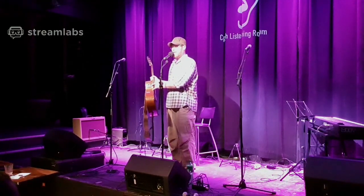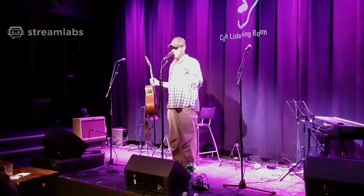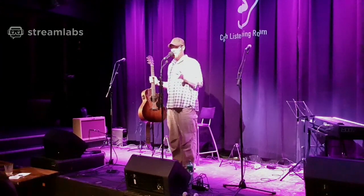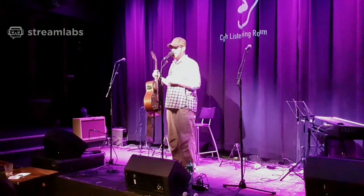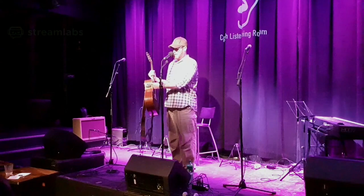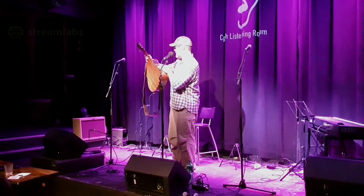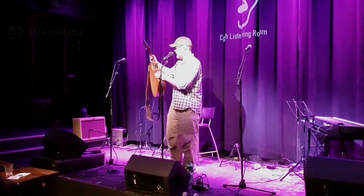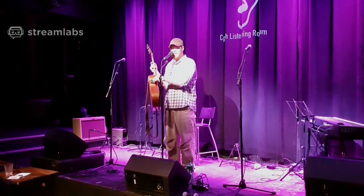And I also have a notch button, or a knob here, where you can try to find the frequency that is causing the feedback problems. Usually with an acoustic guitar, it's going to go... And if you can find that frequency with the notch button, it actually just cuts out that frequency, just that one. How does that work? You just push it down? No, you turn it. Basically, it goes from something to 330 hertz, and you just turn it until the woo goes away. Okay. And if you turn it too far, the woo comes back.